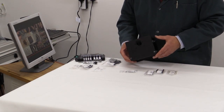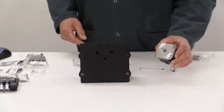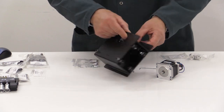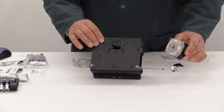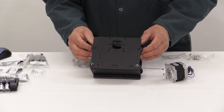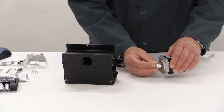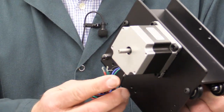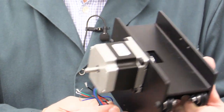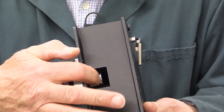After laying those components out, it only took me six minutes to assemble. The next stage is to mount one of the stepper motors onto the X-carriage assembly. It's slightly different depending which motor you've got — I've got the NEMA 23. I'm going to mount one of these pulley blocks on the end, then mount the motor onto the X-carriage, ensuring the wires are pointing downwards as instructed. You can see the little pulley block is on there.